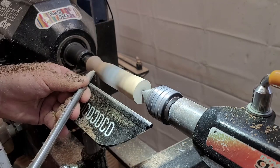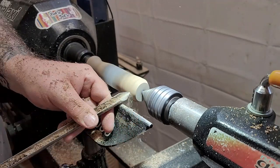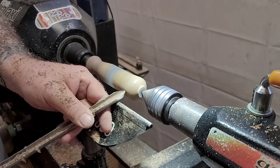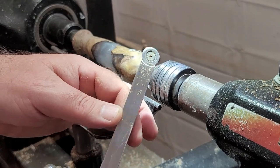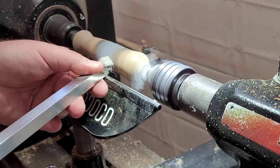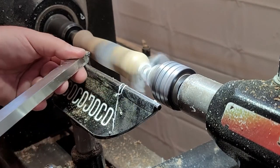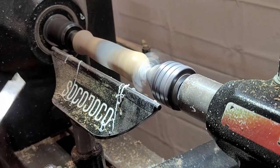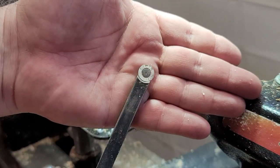You can see I wasn't being very delicate with my cut — getting a lot of chip-out there. Now I'm going to show you the different tools I've used to get really clean cuts with resin. Starting off with the negative rake cutter on the EasyWood Tools full-size set. I'm holding it parallel, going at it dead on, and you get those nice streams — a nice clean even cut with no chip-out at all.